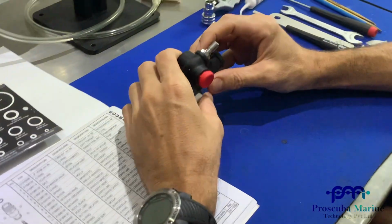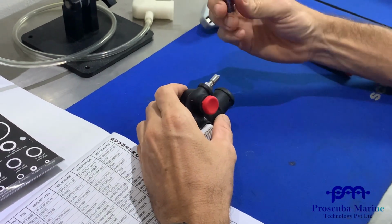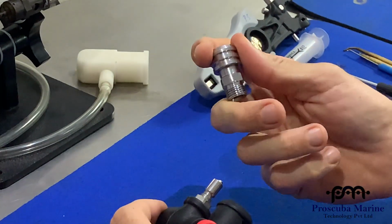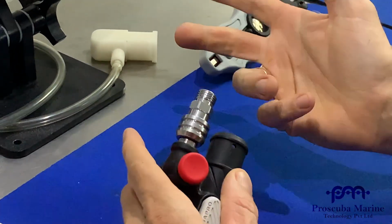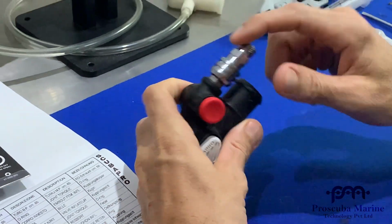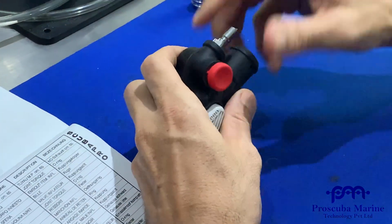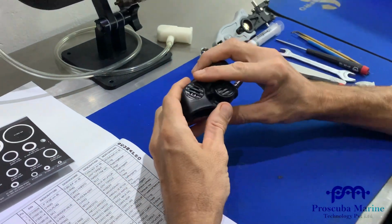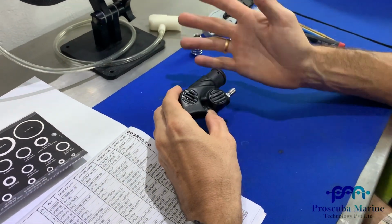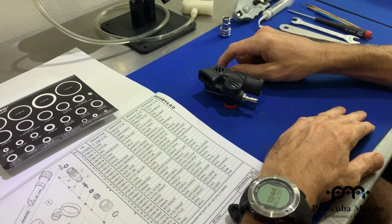The gas comes in from the intermediate pressure hose. It comes through this quick disconnect, actually, which you'll remember as divers, you've used this from the hose, and you can plug it on to your balanced power inflator. I'll do another video after this showing you how to take care of the quick disconnect as well. Really simply, you've got 2 buttons. You need to take the back doors off both of them, clean them up, change the O-rings, and assemble them in the correct order again.